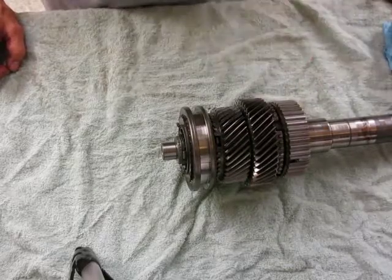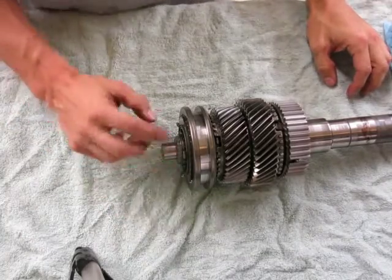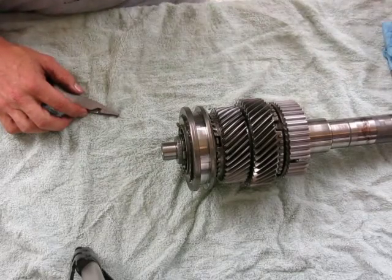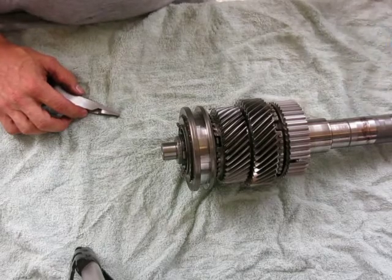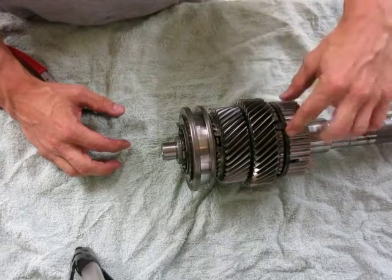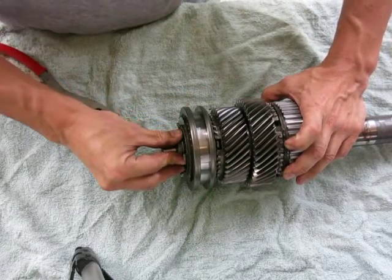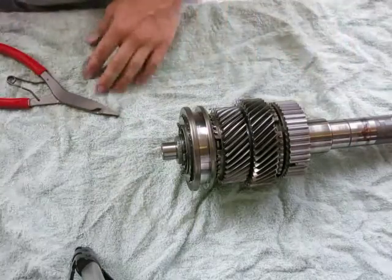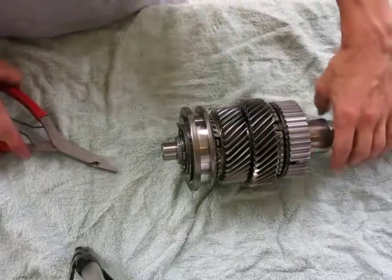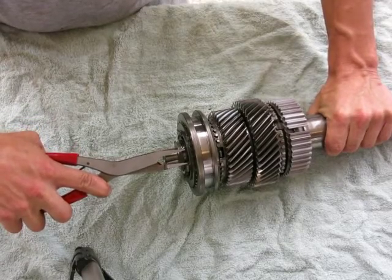Using the gear and bearing puller, I did end up getting that bearing off — it was a little stubborn, but it came off. I started taking the synchro off the other end, but it occurred to me that this stuff has to come off this way, and there's no way right now to get a puller on it to pull it off. So for now I'm going to work on this end and see if I can get everything off this side first. This ring here has to come off, but there's a piece pushing on it pretty snugly, so I might have to give that a little tap if I can't get it to come out.